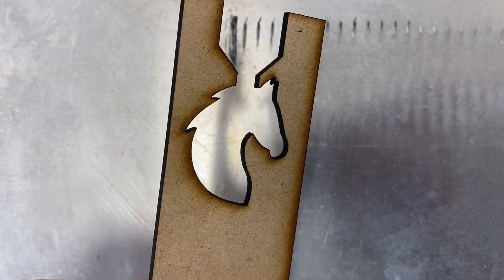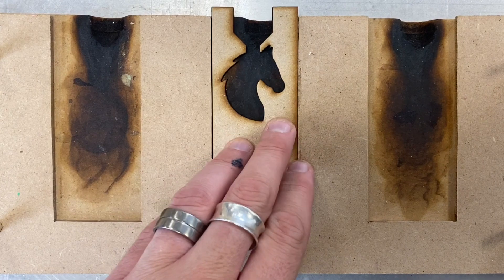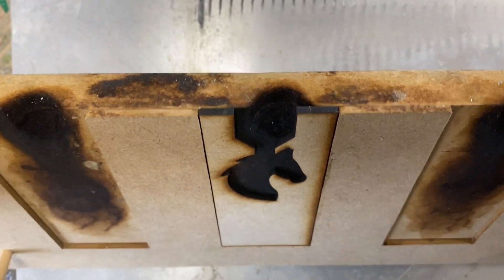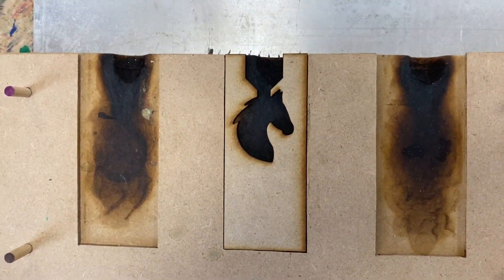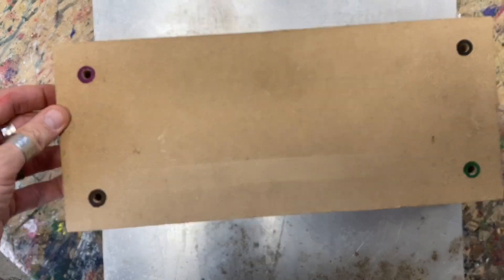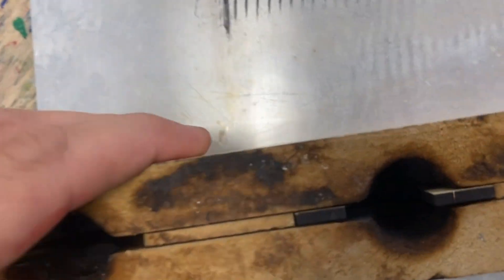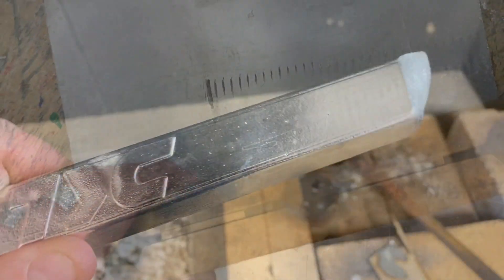Let's go! When you're doing any kind of casting you need to start with a mould. In school we create our moulds using a laser cutter in three millimetre MDF. We then place it into a jig — a piece of wood that's used to guide the position of cutting or casting of something for a repetitive action. In this case we've got three sections that are the exact right size for three students' work, and that gets sandwiched together between two layers. Crucially at the top there is a well for pouring in the pewter that's wider than the three millimetre point.